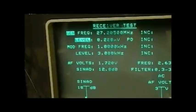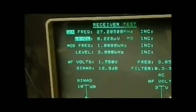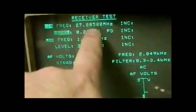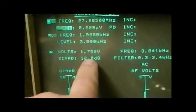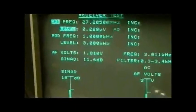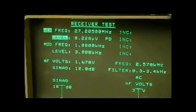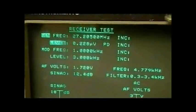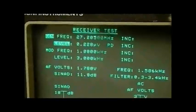I've done a little bit on AM as well, and I'll stick that on the end to show you that with 80% modulation on AM, you're going to get exactly the same sort of level on your signal generator for 12 dB SINAD. So it works exactly the same way on AM as it does on FM. As far as this goes, it might look fairly straightforward to some, but someone who doesn't know it as well probably might not be able to follow my description.